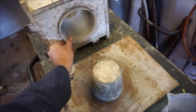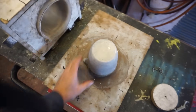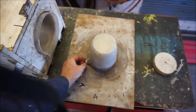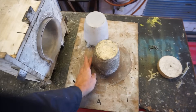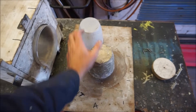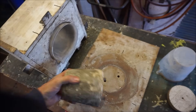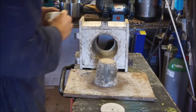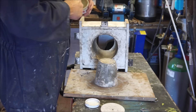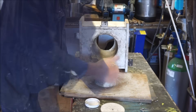That was the one I used for that one and this was the one I used for this one. But I actually cut the mould — I cut the spout off so that I can actually turn this when I'm demoulding the crucible. Just put two pegs in there to locate it. The mould is rubbed liberally with Vaseline so it will demould.